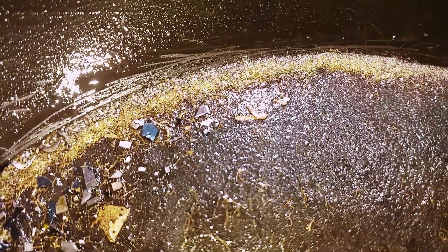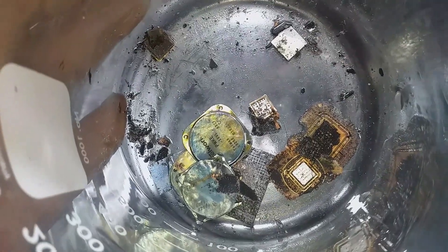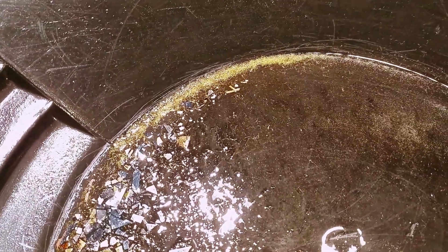This process is actually working — as you can see, that is our gold wire bonding, very nice. But because our material is too small, we just collect it for now and process later on a large amount. This material containing fiber has gold foil and gold plating. The carbon here needs to be collected and saved. Carbon removal here is almost 98 percent, and the remaining residue is fiberglass and gold wire bonding.